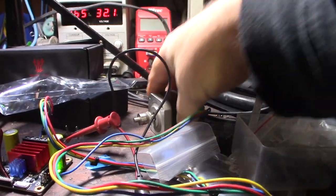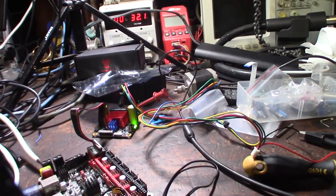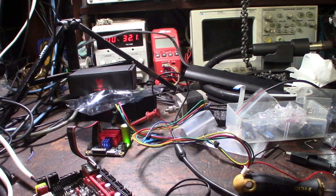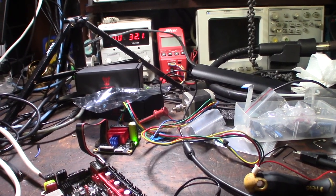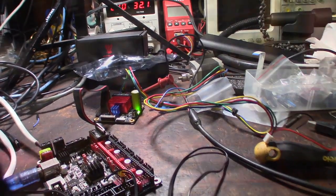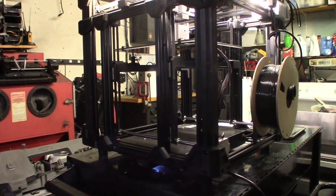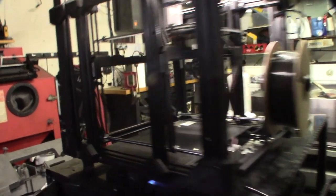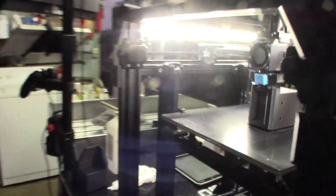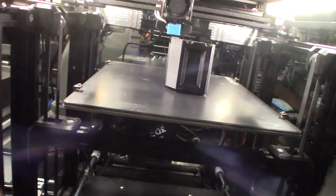All right, I'm going to turn on interpolation. That should actually bring it to higher microstepping, and we should make it quieter. But I'm not going to be running interpolation anyways. When you're going fast with Klipper, the interpolation can make more noise. So right now, I'm actually running this in 16 microstep. So yeah, it's noisier, but it doesn't create a bunch of vibrations. And actually, it's more accurate too, at least the way I find the quality of the prints are better.